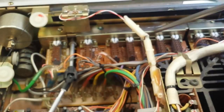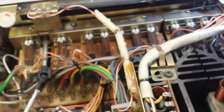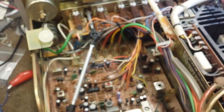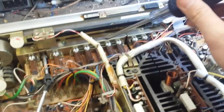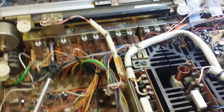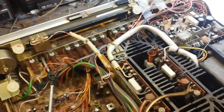The tone controls are a little bit of a pain because of where they're located. There are screws here, here, here, and here — undo these and the switches come up and out, giving you exposure to the tone controls underneath. If you're cautious and don't want to fidget with the wiring harness — which I recommend since these are old, brittle, and fragile — you can take the amplifier boards loose here and here, pull them up and away enough to get to the top row of switches and gain access to the pots you need to clean.